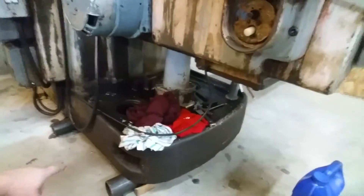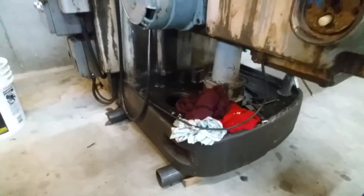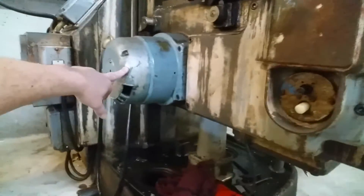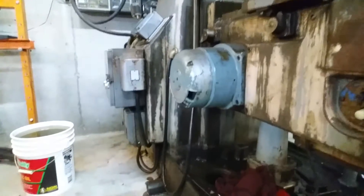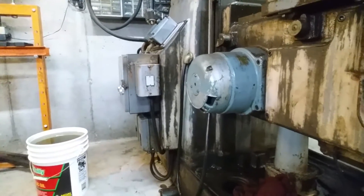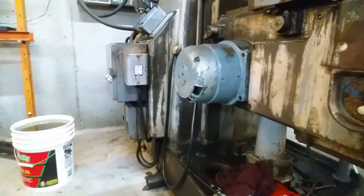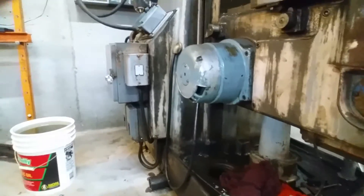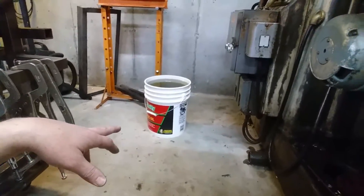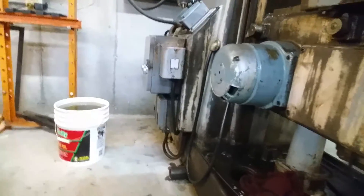I'm not going to get into painting any of this stuff. I'm not sure how far I'll go with cleaning up the coolant sump — it's just nasty junk in there. I'm probably going to go with a standalone system. The knee's got a 2.5 horsepower motor and the spindle is a 7.5 horsepower motor. Right now I've only got a 10-horse phase converter, so I can make this thing run but it's not going to do full power. So I'm looking to get into a 15-horse phase converter. James Green recommended this hydraulic oil from O'Reilly — I just picked up a pump today and I'm going to fill up the knee with that.